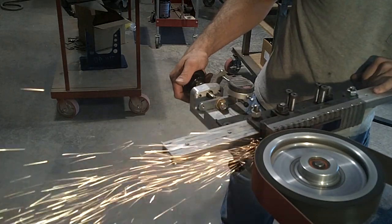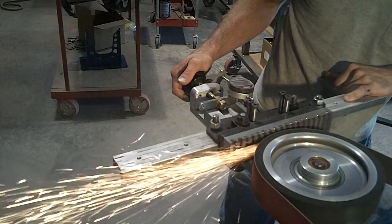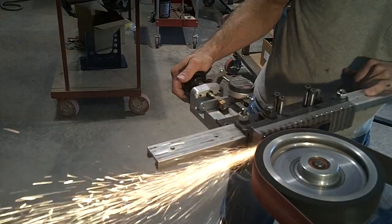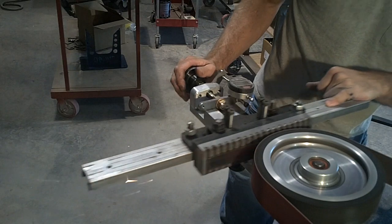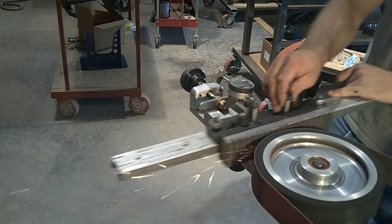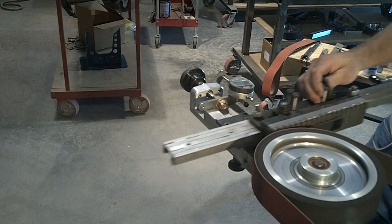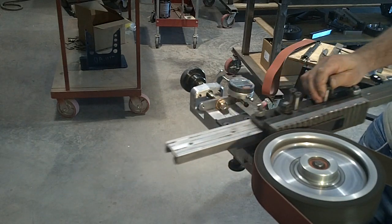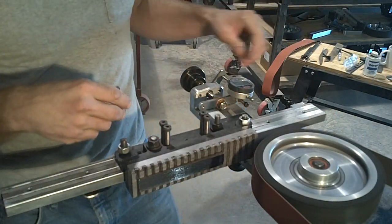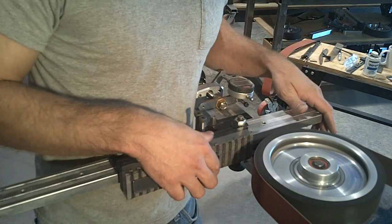The nice thing about tapering a tang this way is you build up very little heat. It's precise, and it really allows you to taper your tangs after heat treating and keep the warpage from happening. Now if this video dies suddenly, it's because I'm going to cut it regardless at no more than 12 minutes, otherwise it's a pain in the butt to load. But luckily everything's pretty easy to use and nothing takes all that long, other than me jabbering. Let that wind down.